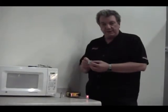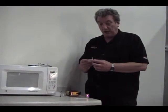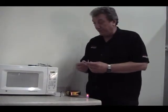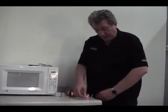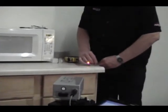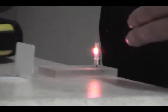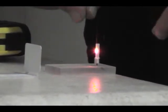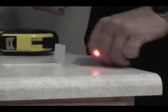We've talked about the pin target, which allows you to capture measurements from any angle whatsoever. Even in cases, for example, where you would be up against a full height cabinet base here, and the angle was terrible, we could put this up against a full height cabinet base, and then the laser would hit this. Actually, it would look more like that. Now, this is exactly 1/2 of an inch from the full height base. These two pin targets could be offset 1/2 inch to get an exact replica of what that would be without hitting this because of the bad angle.